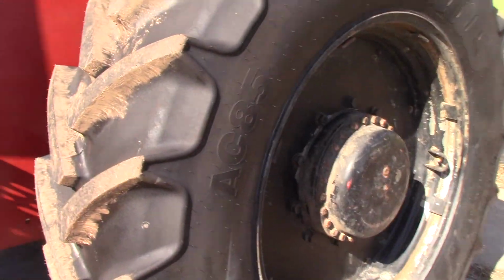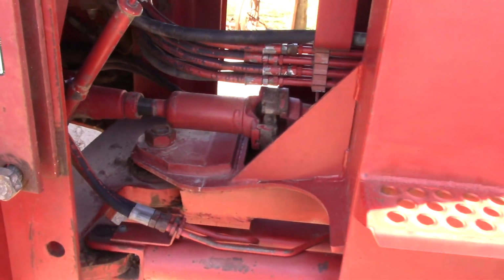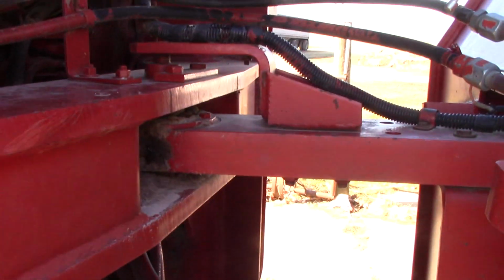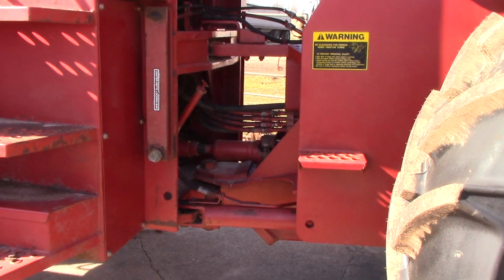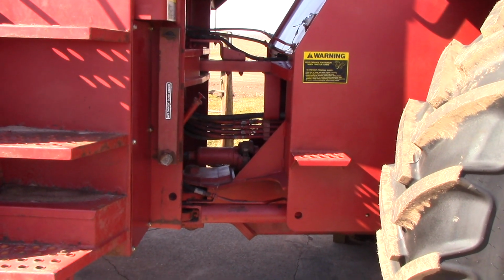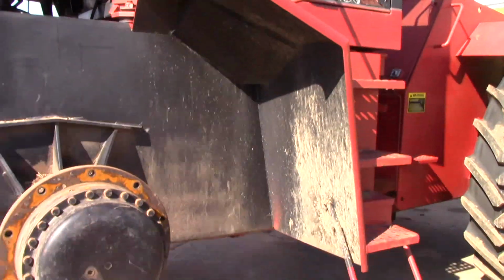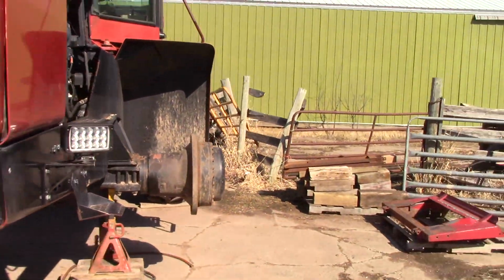We bought it. This was a known issue to us, but here in the middle again, these pivot joints, the uniballs are pretty much worn out. So we get the privilege of splitting this one in half. Again, you pull this lower pin here and this upper pin, split it, roll the back end away from the front end, and put new uniballs in it, new pins. We got all new bushings for the steering rams, so that'll be a fun-filled day with this one to split that apart. And then again, we got a cab kit and a new seat coming for her as well. I think that's all we're going to be doing to this one this spring. But we got to get that ready.